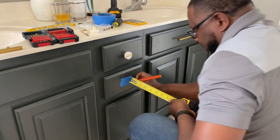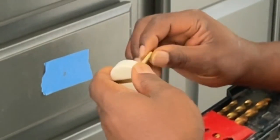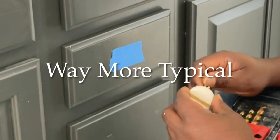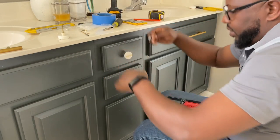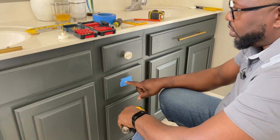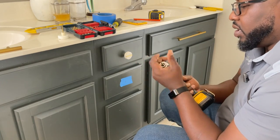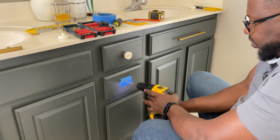That intersection right in that little box is dead smack center. The thread on this knob is already attached to the knob itself — some have separate screws that go from the back of the drawer front into the knob. You want to use a drill bit that's a little bigger than your actual screw. If you're concerned about splitting the drawer, you can do a pilot hole first and then come back with your full bit. Hold it level and drill right through the center mark.